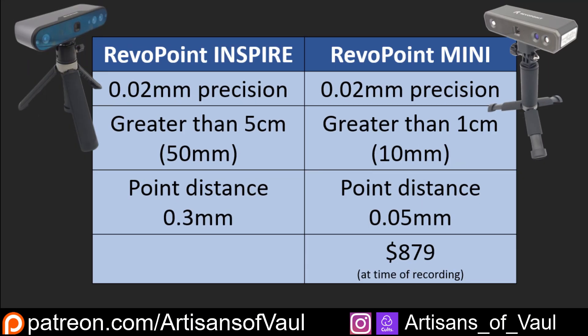The final thing to do is have a look at the vital statistics of these two scanners. In the precision department they are identical — they can go up to 0.02mm, so 20 microns, in terms of precision they can pick up. And with a point distance of only 0.3mm, the Inspire is still able to pick up really, really fine details. Now it's not going to go as fine as the Revopoint Mini which is 0.05mm, but as we saw on the tank and on the boot, it will pick up really fine textures and any differences that you'd need to model off of. So this is more than capable of doing pretty much anything you're going to want, bar scanning an individual infantry model. And it's absolutely brilliant for scanning something that's a real world size and then shrinking it down — I think that's where this shines more than anything else.